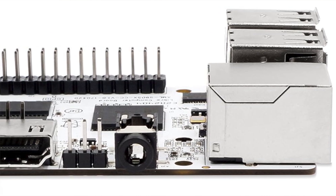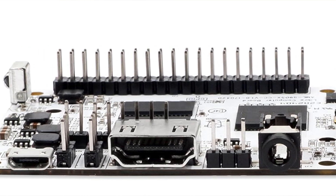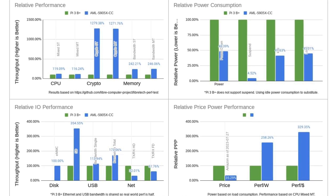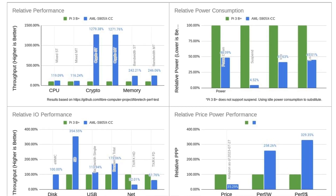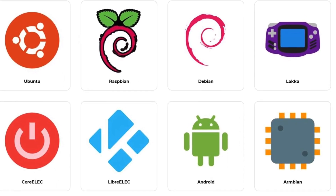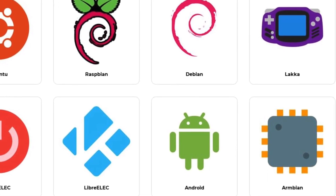The connectivity suite features a 40-pin header supporting SPI, I2C, PWM, UART, and more, making it very versatile. For software, it supports Raspbian or Ubuntu. Memory-wise, it comes equipped with 2GB DDR3 RAM. It's perfect for the digital explorer who demands performance without breaking the bank — whether you're a budding developer, a hobbyist diving into SBCs, or someone who wants to binge-watch 4K content without spending a fortune.